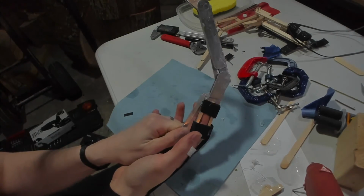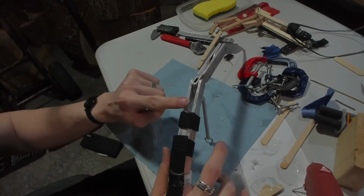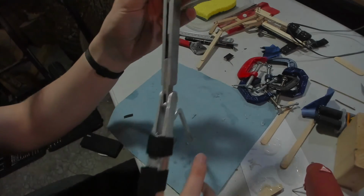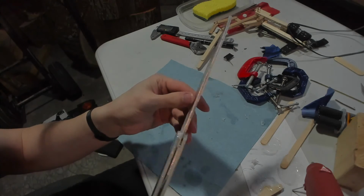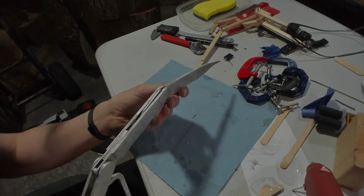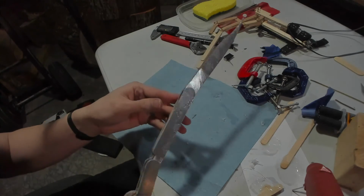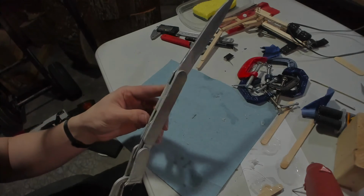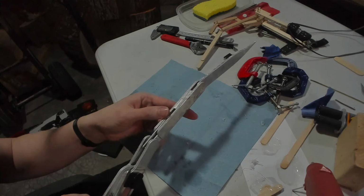It looks neat. So, thinking with the brazing, I'm not going to need these side plates, so those don't need to get doubled up. Same with over here. I'll probably just go with a single plate for that one too. And then probably make these supports a little bit smaller in here. And with the brazing, they definitely don't need to be as big. Won't need as much surface area for the epoxy.